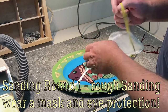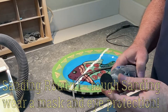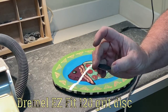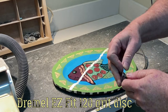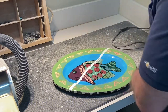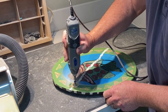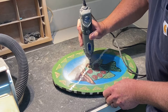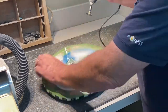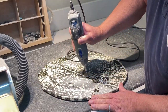After cure time — usually overnight in a 140-degree oven, or several days at room temperature — it's ready to be sanded. We use a Dremel Easy Fit 120 grit. That process is applicable only to glazed items with a very resistive surface; we don't use it on porous or soft material. Please wear a mask and eye protection, and make sure the room is ventilated.